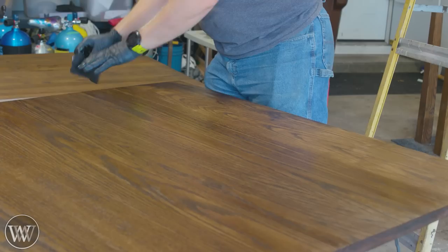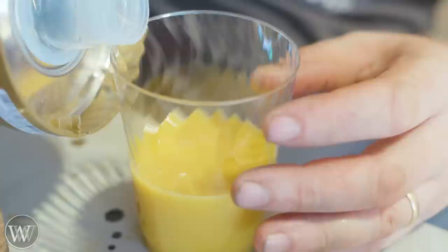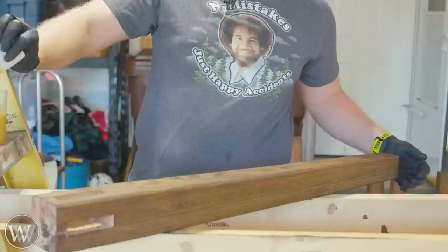So we'll put the stain on there and let it sit overnight. Actually, it was almost 36 hours or so before that, and we're going to coat them with Rubio Monocoat. Now, I could get a Rubio Monocoat that comes fully tinted and would be all in one process. I really like that. But in this case, it was better for them to do it in two steps and have the stain and the finish separate.